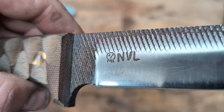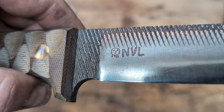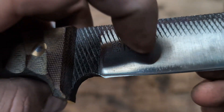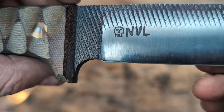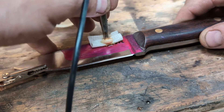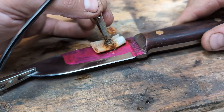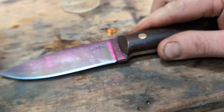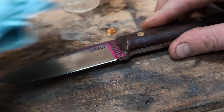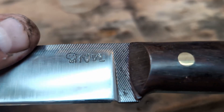Here's an example of another one I did with this same setup. You can see that it's a really nice deep and dark etch, and you can just experiment with how long you hold that etcher to see how deep you get it. Let's try it again one more time — I've got one hooked up here. We'll speed this up and you can see that it produces some nasty oxides and stuff in that vinegar solution. You just wipe it off, use some acetone to clean it up, and really quickly you have a nice etch on your blade. If you want to invest in some professional stencils you can get a much better result, but this is really good for such a cheap and easy setup.